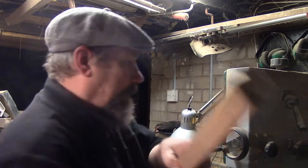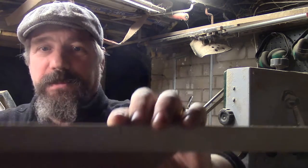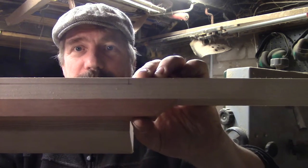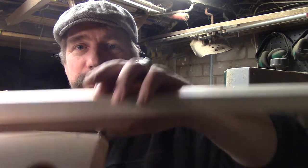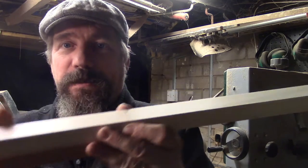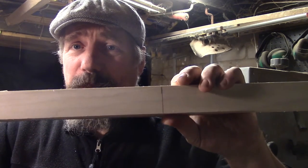That's the box and it's going to fit in — let me put it on the bench so you can see what I'm doing. We're going to glue these two pieces together. They're the same width, but honestly I find it a little bit easier if you've got the back strap piece a wee bit wider than the other, because otherwise your glue-up has to be absolutely bang-on accurate.